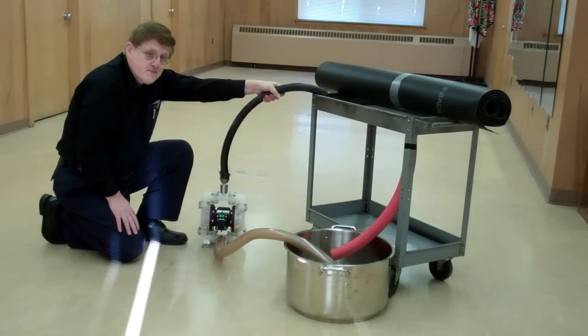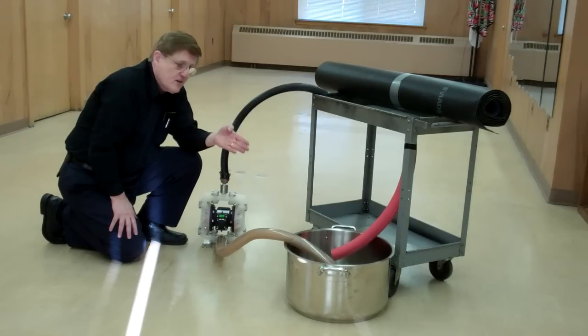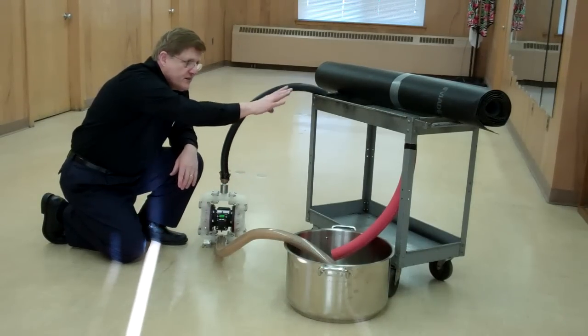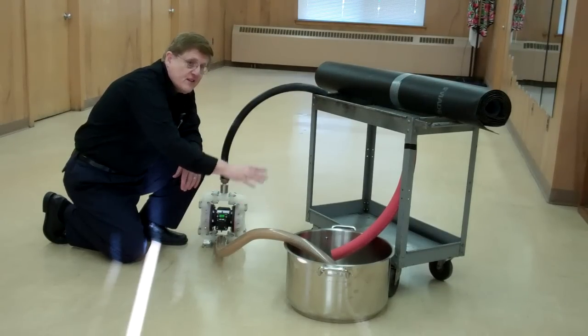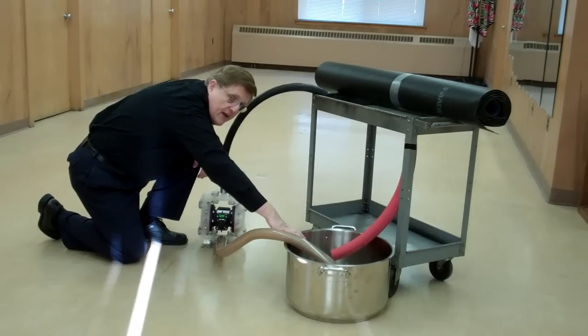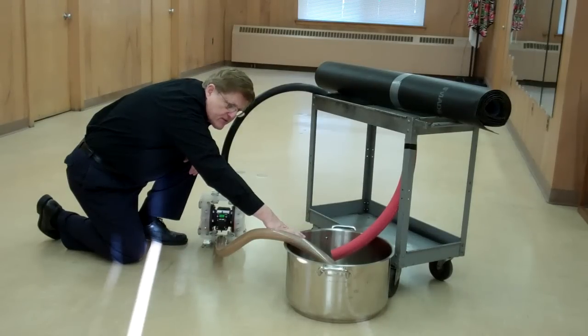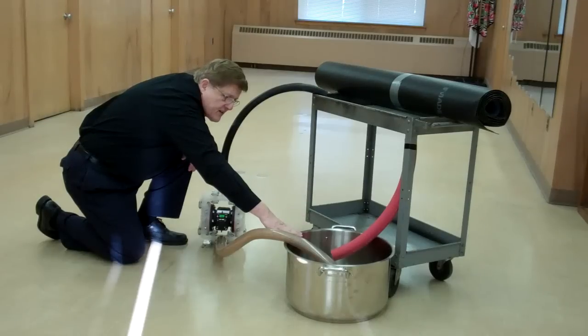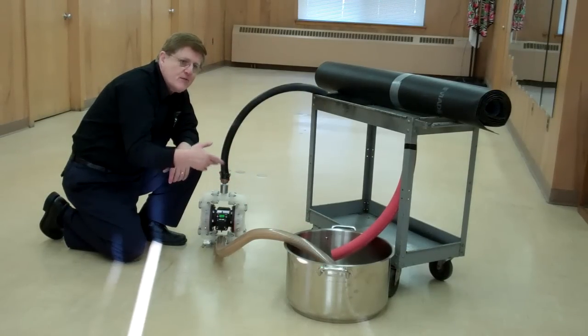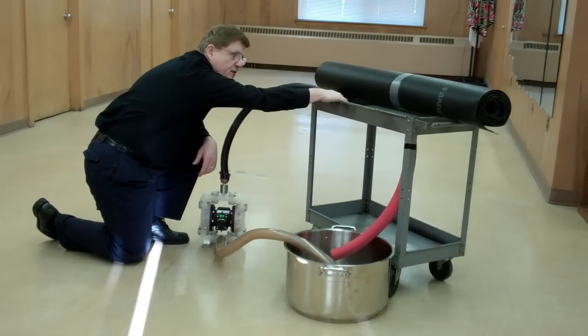In-tank mounting is the conventional norm on simple open gravure presses. The in-line viscometers were developed for the flexographic printing industry with the advent of automatic washing, where they used 5-gallon or 20-liter ink tanks for flexo presses and had tank-mount viscometers for decades. Then the industry wanted to automatically wash the doctor blade chambers, printing plates, and anilox rolls — which you can do in flexographic because you have a sealed fountain, unlike gravure which is an open fountain.